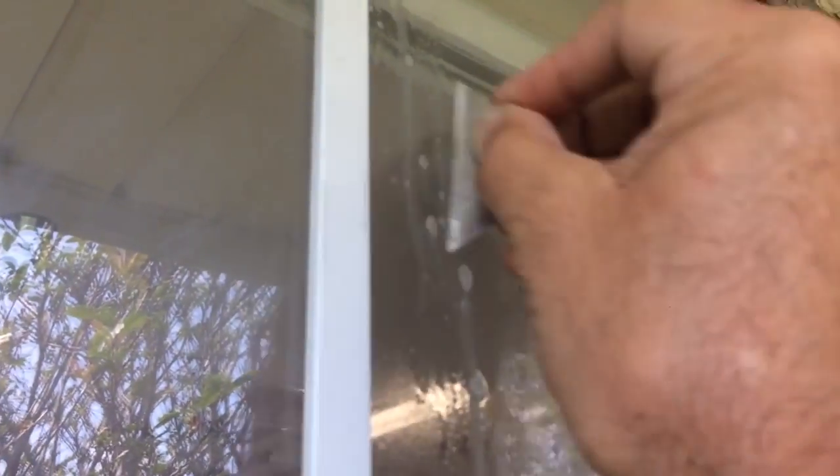If you try to scrub it off without anything it doesn't really come clean — it does a little. What I did, I made a mixture up with some vinegar and water, then scraped it all down with a razor blade. You can see it peels right off. Then go back over it with a dry cloth and you've got clean windows.